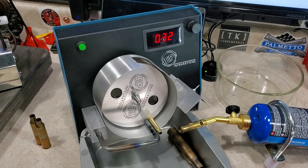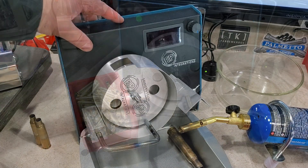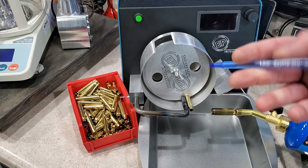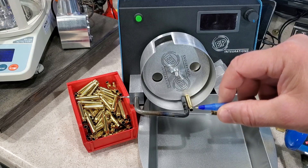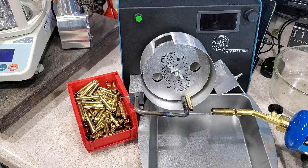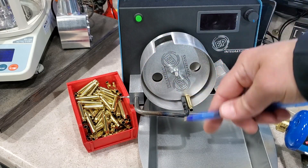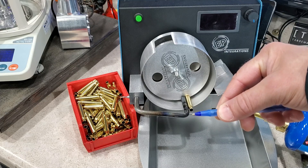That's where the EP 2.0 annealer really shines — no parts to add or remove, and it adjusts in 30 seconds or less. When setting up flame-based annealers, I use the glow method. I get the neck and shoulder to the point where they just start to glow and drop the brass out — and that's where the speed control comes in. I like to get the hotter inner blue corona flame at roughly one inch to one inch and a quarter long, with that flame pointing directly where the neck meets the shoulder.